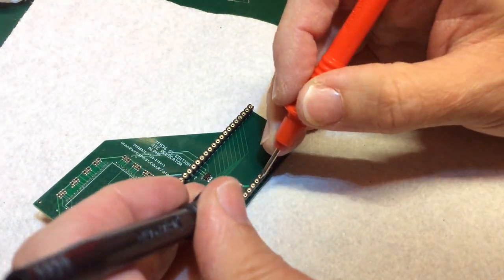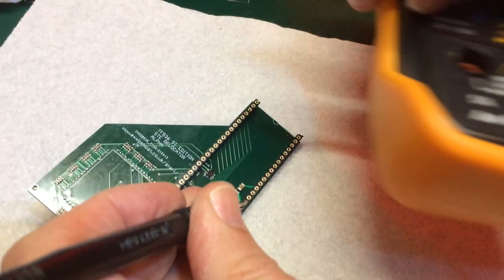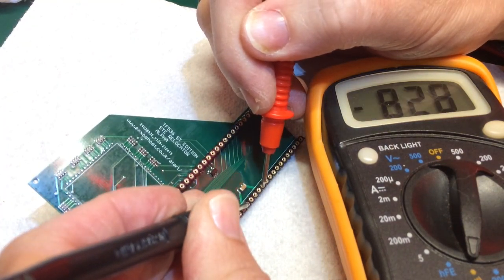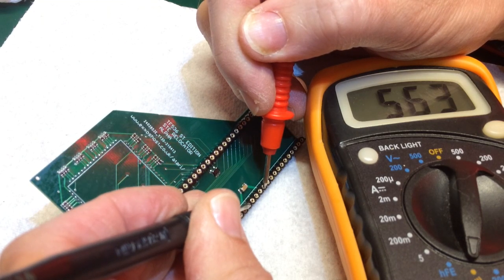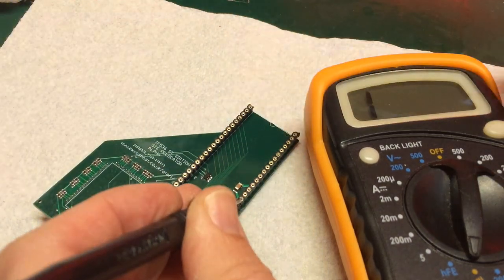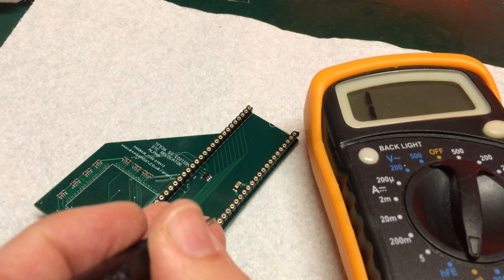We should have a capacitive load here, no short. Sure enough, it charges. No short. So the reason we don't have an open loop there after charging up is presumably because of that Schmitt trigger there, which is across the power rail, obviously drawing power. So that's fair enough. So good, no short to ground.